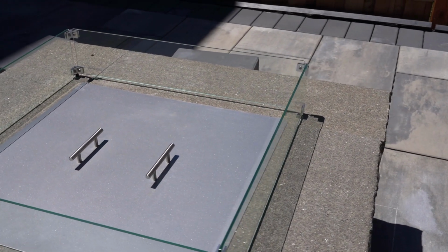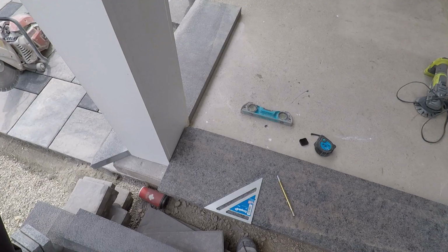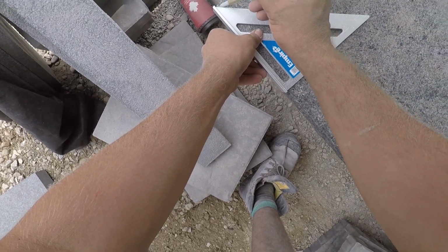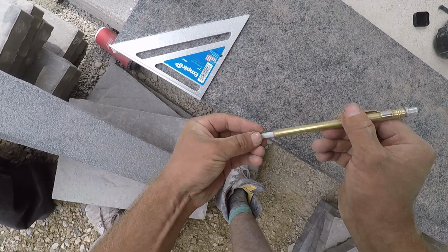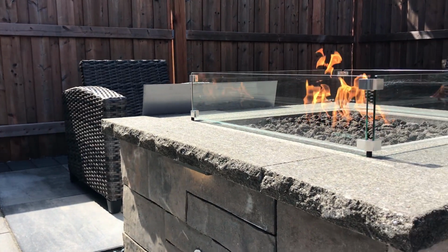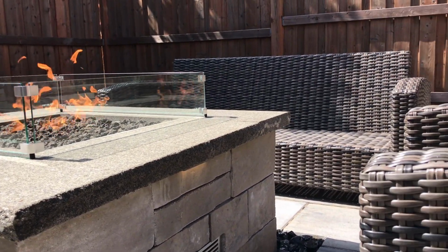Whenever I can, I will not miter any of my pieces, any of my cuts in these to make it fit nicely. Not that I completely hate miters, but personally I just don't enjoy it aesthetically. I don't think it's aesthetically pleasing when compared to just squaring it off and running a soldier sailor course or caps square to that, rather than having to miter.